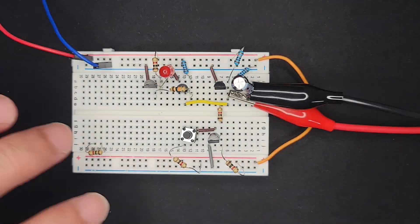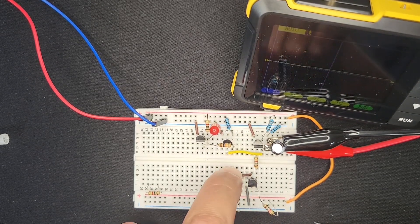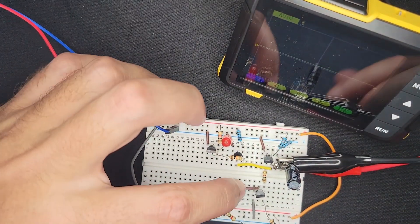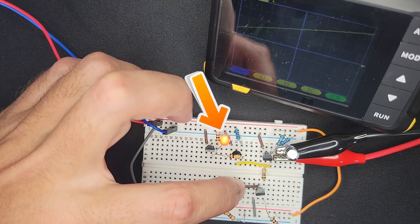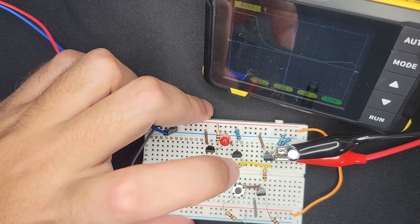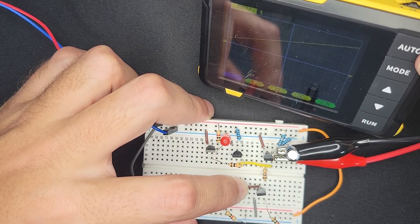Let's plug in our capacitor. The oscilloscope will be off to the side. Let's plug in power — capacitor is staying low. We hold the button and nothing happens. I forgot to connect my ground — let's connect the gray cable. Trying again: capacitor is staying low, that's a good sign. If we press the button, we're climbing up now — and the LED turns on. Now if I release the button, the LED turns off and the capacitor discharges quite rapidly. So if we're charging and holding, then let go, it drops back down. This is kind of what I wanted — a long press and then the LED turns on after a delay.